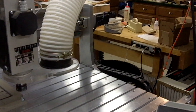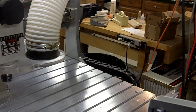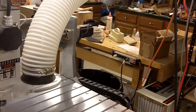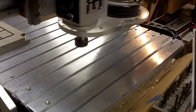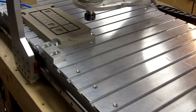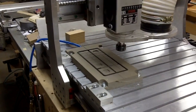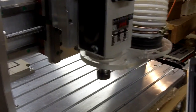Now it is worth noting that if you go into the general config and change the look-ahead to 100 lines or whatever, you can see it's moving very quickly. The rub is, the parts come out very inaccurately when you do it this way. So yes — very smooth motion, very inaccurate parts.